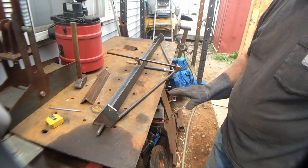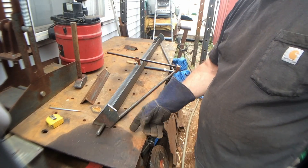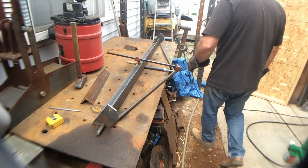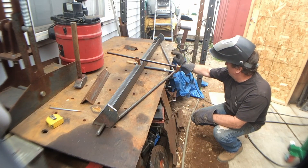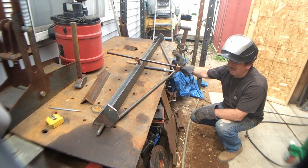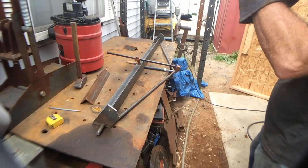For the tension rod, I brought it just up off the face a little bit so I can get a good weld all the way around — plus it fills the gap there. I brought it off to where it's just about flush underneath. It looks like we've got that pretty even on both sides, so I think we can go ahead and tack it in place.